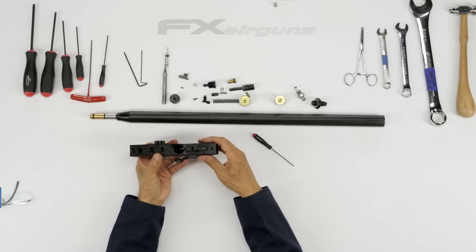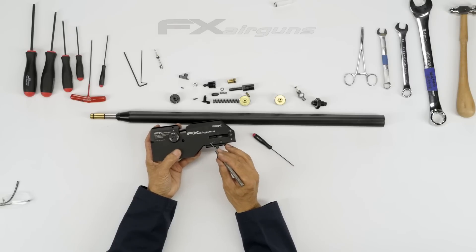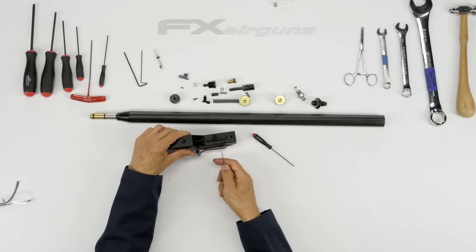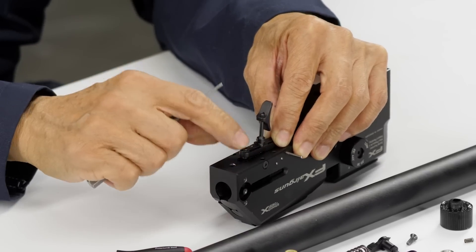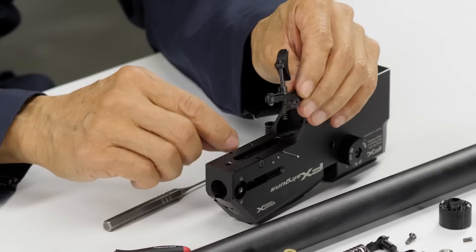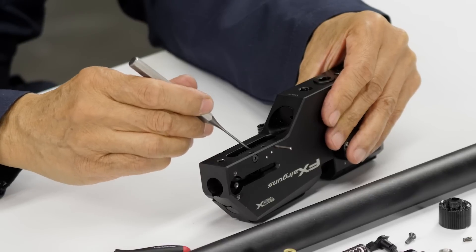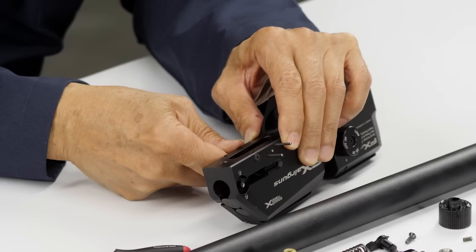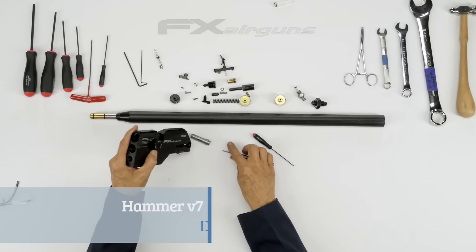Your hammer is not going to come out until you remove the trigger assembly. There are two pins here that we have to partially push out to clear the bore on this trigger plate. Start with the top one on the trigger roll — don't push it all the way out, just enough to clear the trigger plate bar. Be careful and hold onto it because there's a spring underneath. If you push it out without paying attention, it'll just fly out. Now inside here, this sear engages the hammer — we're going to remove it because you can't get the hammer out with it in the way. There's your sear. And here's your hammer.